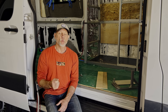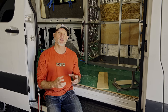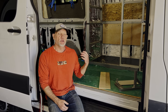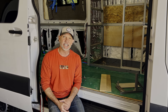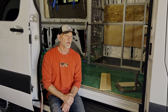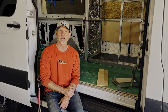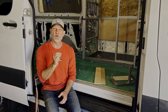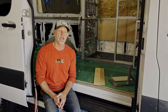So if you've made the decision to go with a wet bath in your van, it's likely that you're planning to spend a lot of time in the van off grid in remote locations. The way we build the vans and the complexity behind them means that you have to be very diligent about how secure this structure is. Because the last thing you want — this is a moving vehicle that bounces around, rattles, moves a lot — is to have plumbing and drains and faucets, shower heads that are rattling loose, creating leaks. My feeling has always been with these vans, especially for four-season, all-weather living, is while wood certainly works, I tend to like to lean towards building vans with what we call extruded aluminum. It's an all-weather product that's highly durable, very strong, but very lightweight. It's going to give you completely square angles; you can lock everything down and ensure that all of the structure in these vans — whether it's the shower, your overhead cabinets, your kitchen galley — are incredibly strong.